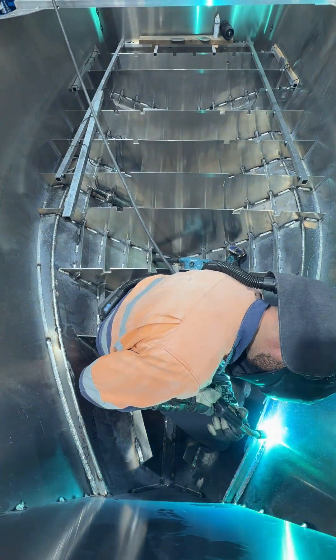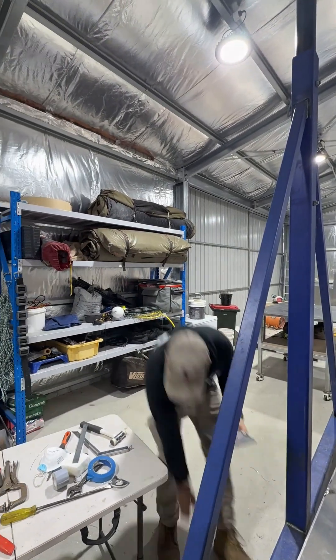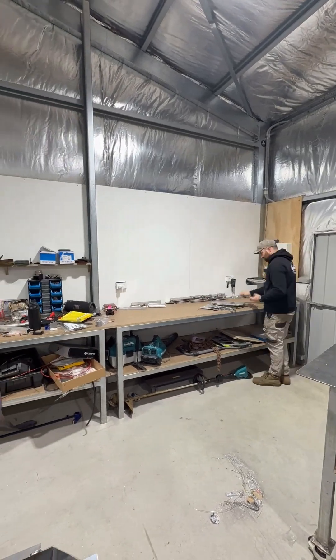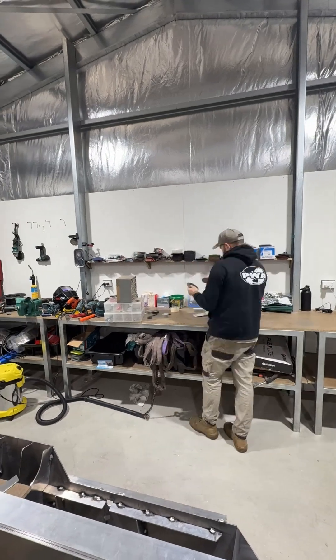I was backstepping this one again to try and limit the amount of stop-starts, keeping them nice and close together. Those last couple of runs were probably 350 to 400mm long. It probably looks a bit longer with the fisheye lens. Then I went through and made an absolute mess of the shed, so I tidied everything up and got rid of everything.